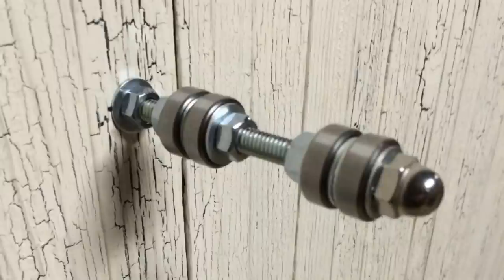So that's just a threaded bolt. Originally that was a metric dowel that I purchased and had to turn down, but in the end that didn't work well, so I found a bolt I could use. The other thing I needed was spacers, and for this application, using washers and nuts is ideal because that way I can adjust them to get the hands just right.